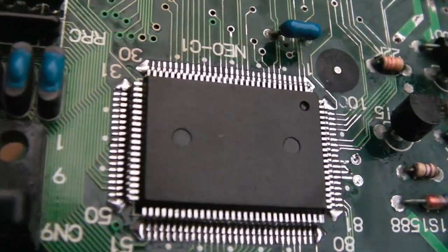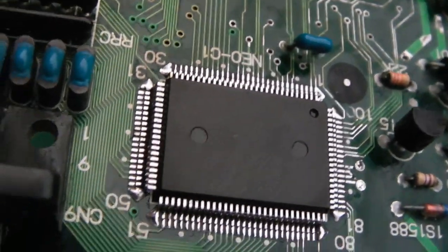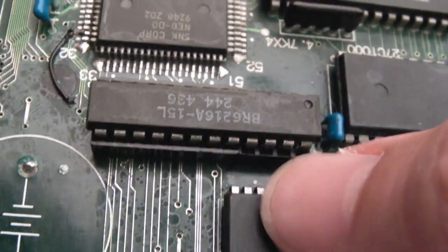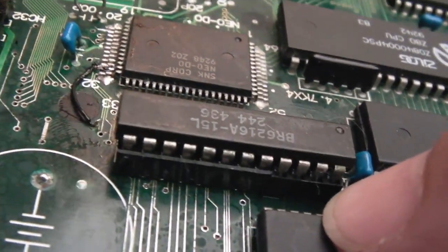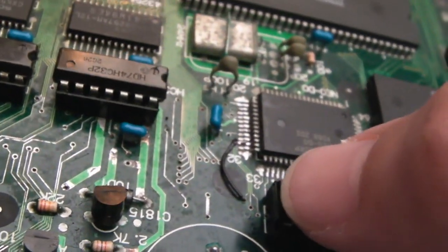So we'll give that a try now. You can see we've got some good solder points on there. It almost looks factory. The corner points perhaps need a bit of solder removing there, but that's not too bad. In general, it's not too bad actually, the recovery. You can see I used two different sockets here. Can you see the height difference? It's totally flat and straight on the board. It's just the height of the sockets are different.